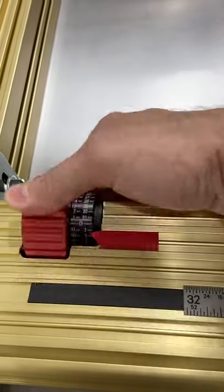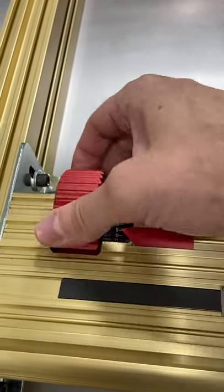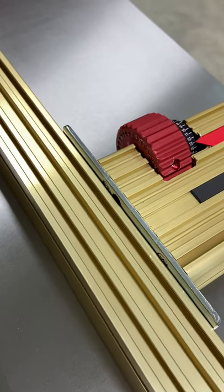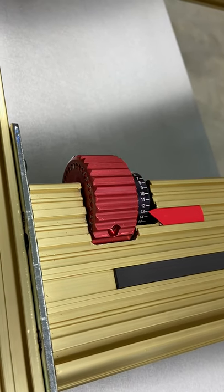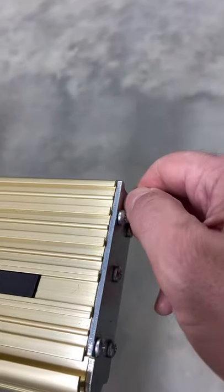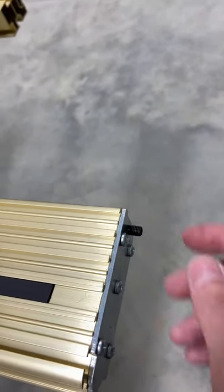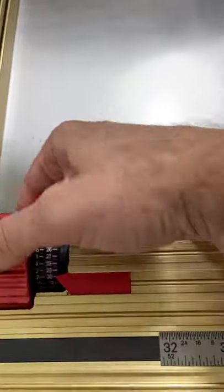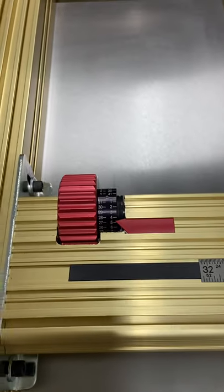The lead screw seems to be rubbing on something at some point, and there's just an excessive amount of tension required to rotate here. The tensioner on the front has been adjusted out to no effect. The indents on the micro adjustment have been greased with white lithium, and it's fully finger tight now, which is all the replacement guide recommends. That was the only guide I could find for adjusting this — and there it is, it keeps doing that. That's the issue, along with it just being generally too tight.